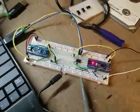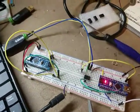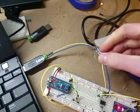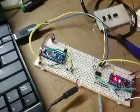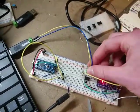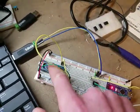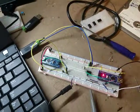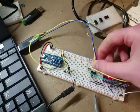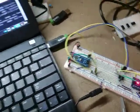Now you might be thinking: why does this matter? This uses RS-485 — this is not a normal USB cable, this is an RS-485 bus. So while I've only got one Arduino on here right now, since it's an RS-485 bus I can add as many as I want. Later on I'm going to add another one, and then I'll be able to run just two wires — like thermostat wire — between a bunch of Arduinos and control all the Arduino stuff on the layout from one CMRI connection. JMRI will never even know the difference.